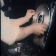Now follows a series of painstaking inspections, further electroplating, and other mechanical processes. Finally, there is evolved an extremely durable reproduction of the master with a nickel-plated surface, this being known as the stamper. In the press room, 2 stampers are placed in a press, one for each side of a double-face record.